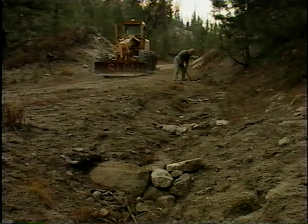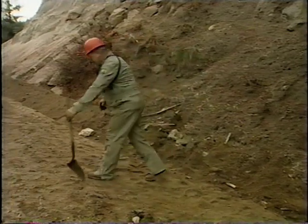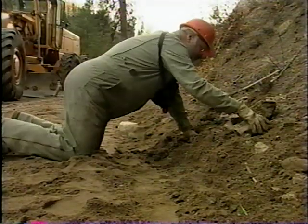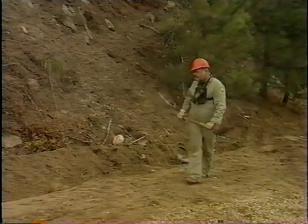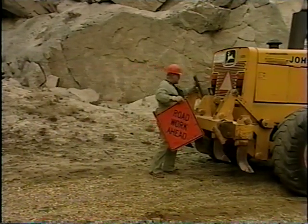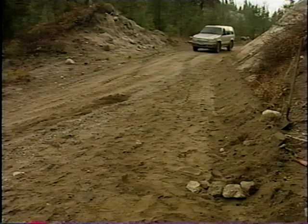When you've completed the pass with the grader, go back over the area with hand tools and clean any culverts, lead-out ditches, or drain pipes. You're then ready to replace any riprap or ditch dams you've removed. Inspect your work and remove your traffic control devices and safety signs. Remember that healing is only a temporary solution — when the stored ditch material interferes with drainage, it must be removed.